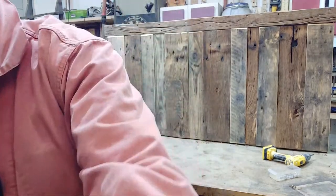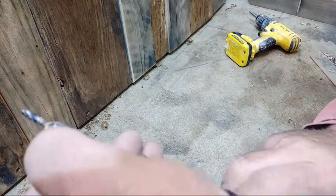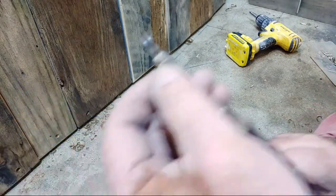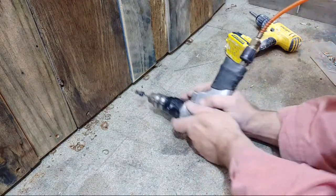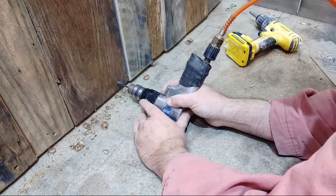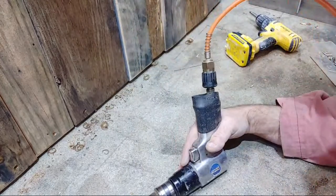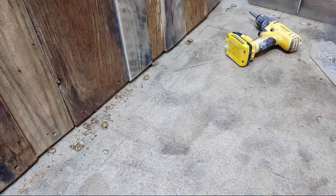Show you a bit closer with this drill. So basically it's an all-in-one drill and countersink, but it's also 10mm across here, so it can take a 10mm plug. So I drill in half, like so. That's created a clearance hole for a 10mm wooden plug. I better be careful because I've got a funny feeling I'm about to push this off the edge of the bench. So I better put it back.